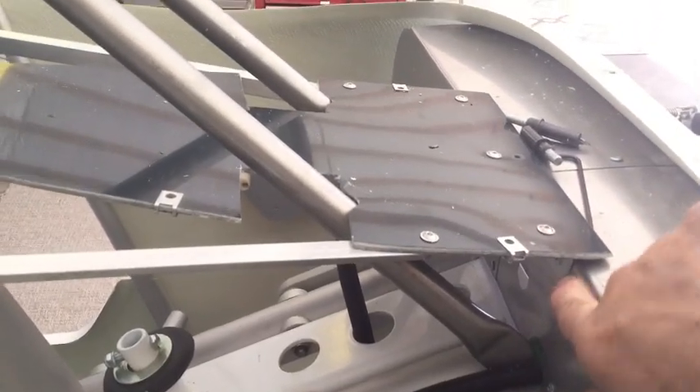The throttle cables are not hooked up yet but the throttle levers are in. A tip for building the instrument panel: the manual isn't the most efficient way to build it. My suggestion is to build this first off of the plane — attach all your pieces with two rivets and one bolt, the same on the bottom, and assemble the whole thing with the top angle and the bottom two angles hooked in, all on a workbench. It's much easier than trying to do it in the plane.